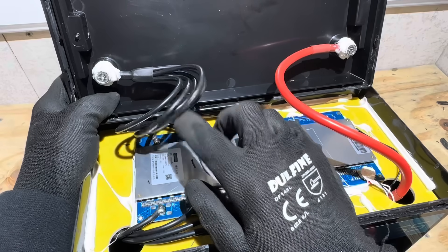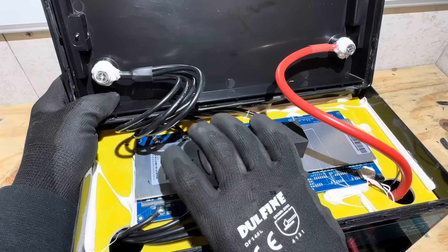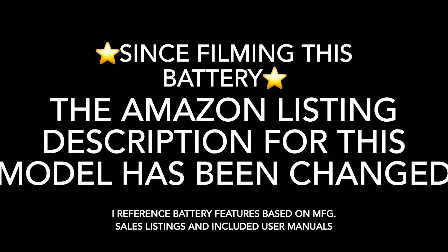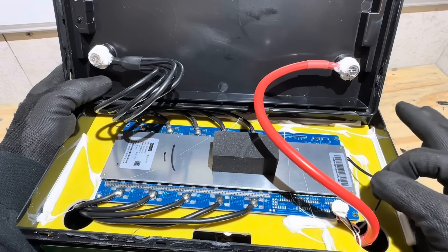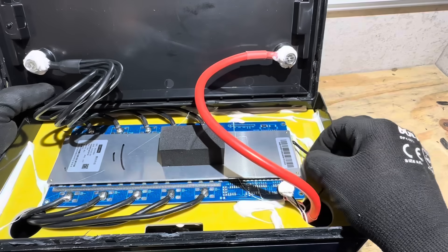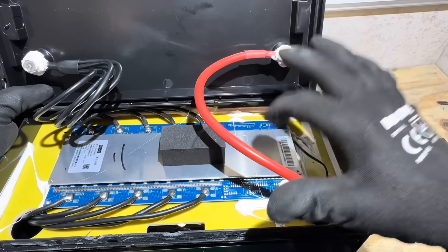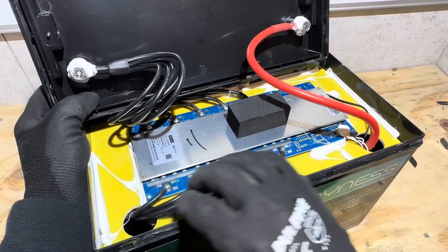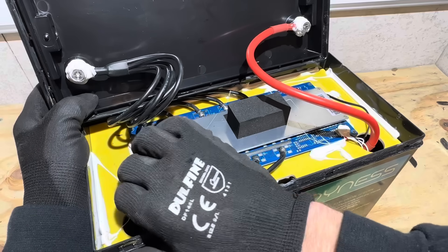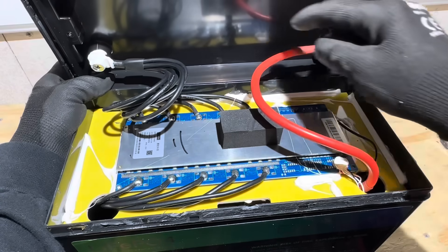This Cyhang 100-amp BMS is a very good BMS — it's used in a lot of different batteries and is a very popular choice for many OEMs. We've got an NTC thermistor with a sensor going down, and the balance lead connection is right there. Dyness is not advertising low-temp protection, but this Cyhang with this sensor is normally programmed with a low-temp cutoff — we'll have to see. There's also an epoxy board sitting on top of the cells, battery leads from the BMS going down through an opening, everything siliconed in place with sealant so nothing will move. Plenty of space around everything, no pinched wires.